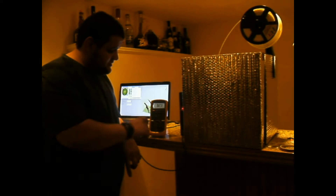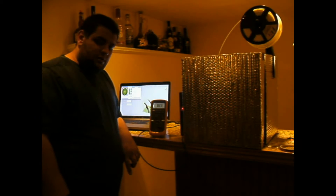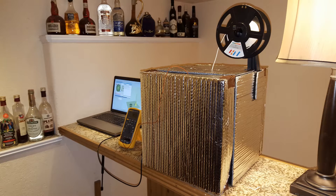I did several tests to determine the temperature of the bed in relation to the setting, and with the bed set at 90 degrees, it heats up to 82 degrees Celsius. The reason I turned down the bed temperature was I read online that 110 is dangerously close to the glass transition temperature of ABS, so the reason I might be getting that warping right near the bed is because it's too hot. With the heated build chamber, I should still be able to print without it coming off the bed because it won't be warping as much during the print.